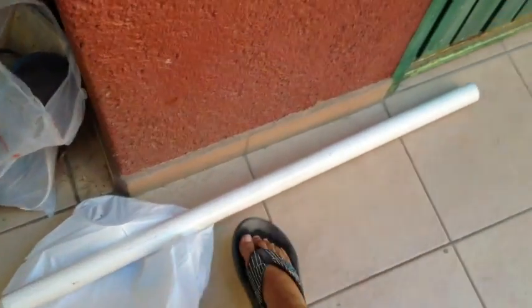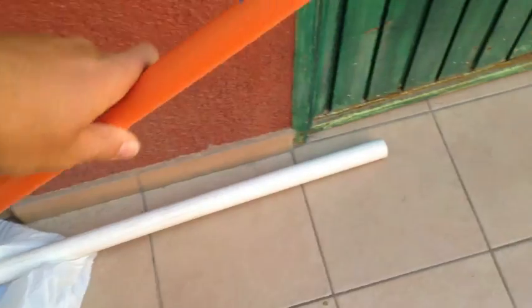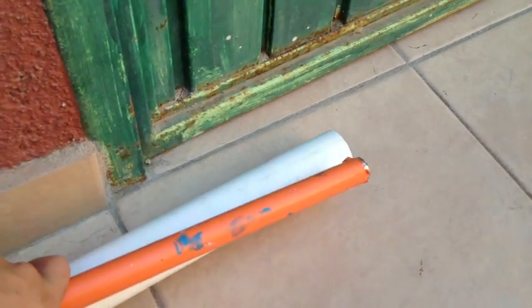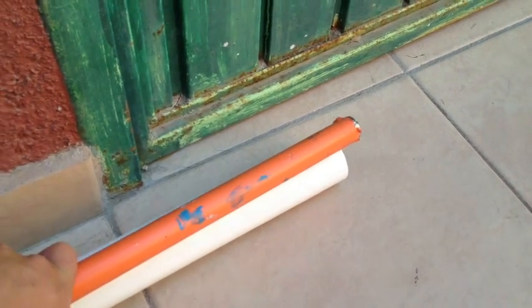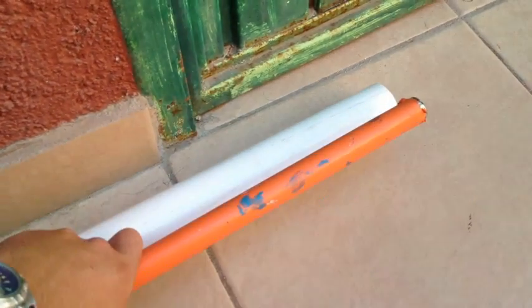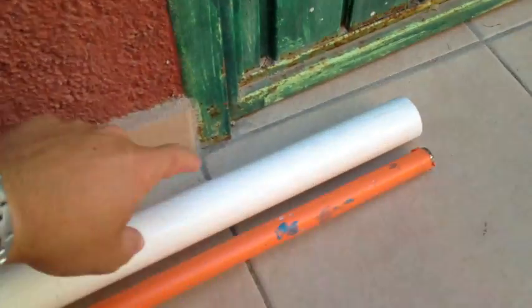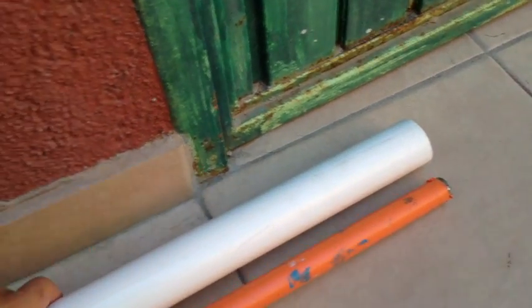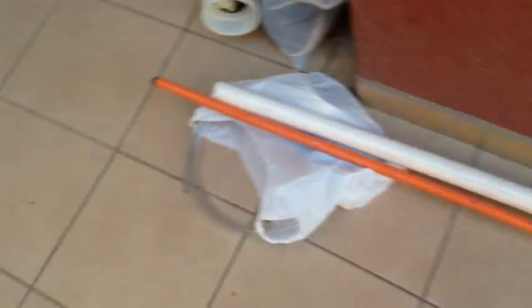I actually bought this piece here - it's about a meter of PVC pipe, and I'm going to put this inside of it. You're going to run hot steam through one pipe, and there's going to be cold water in the bigger pipe. Then steam is going to condense. The nice thing about this, as opposed to the coil condenser, is I can just angle it at a nice steep angle, and I know that the water will run down. Instead of coils, it could be a little uphill - like we didn't bend ours very well. Pretty happy about that.